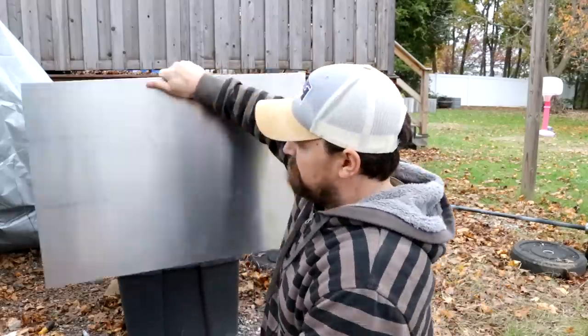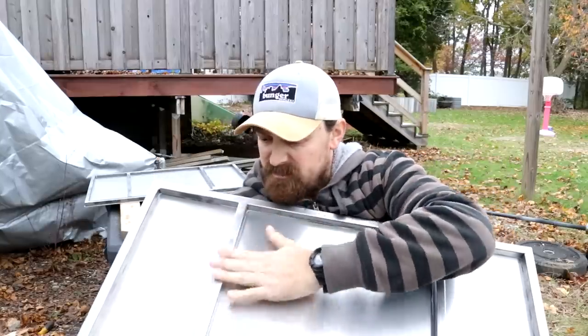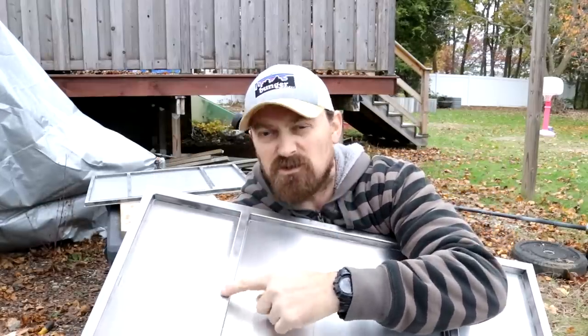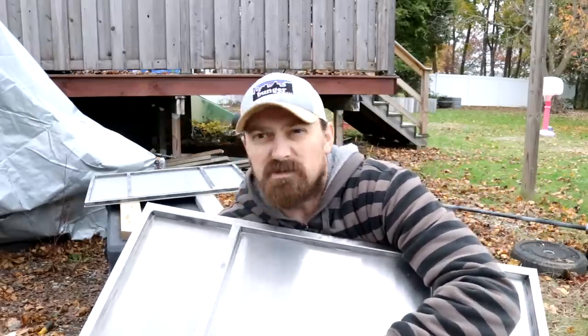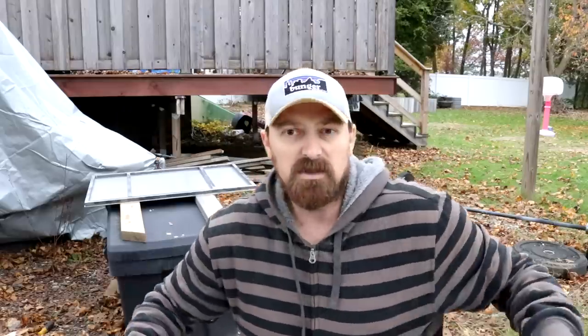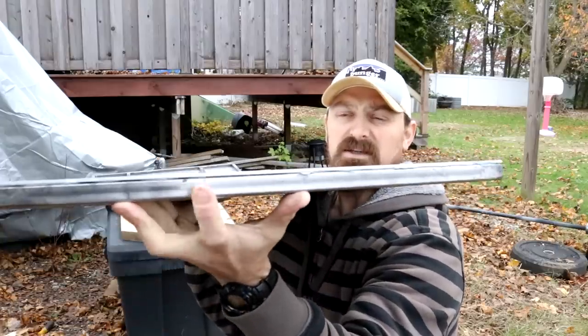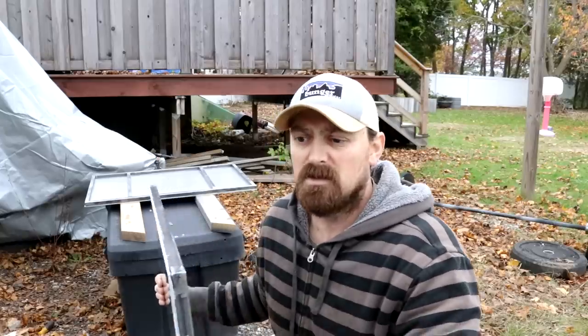What's going on everybody, it's Friday. The doors are all skinned and I'm going to prime them right now. I got back late last night from food shopping, so everything was in the dark, couldn't see anything. Front of the door is aluminum, and you can see the framing — this is three-quarter by three-quarter steel. I'm using a weld-through primer so if I ever have to make changes I can still weld through it. The aluminum is one-eighth inch thick — I went with the thicker aluminum to make the door feel nice rather than go with a real thin sheet metal.